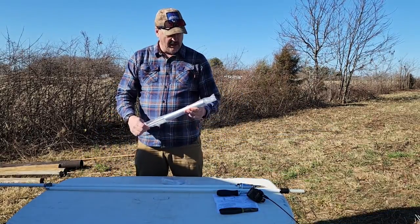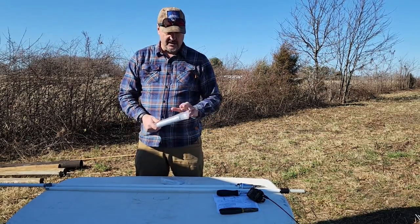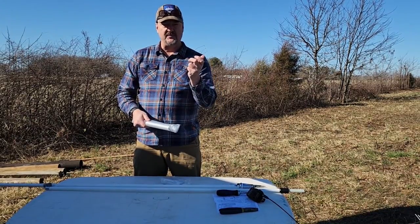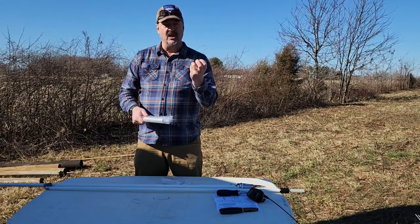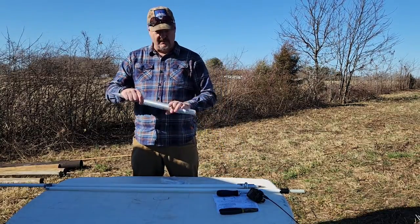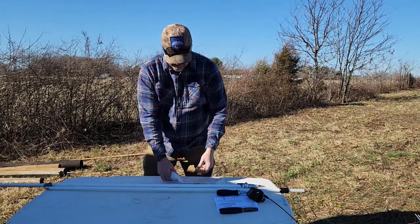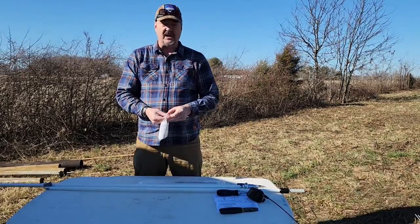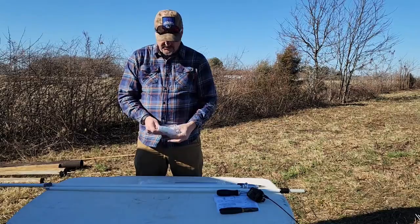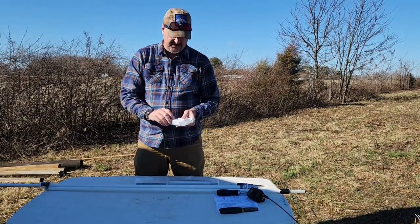We have a bag here. Looks like we've got our radials and the collar that fits down so that you can protect the UHF connector, PL259, that connects to the bottom of this guy from the elements. So we'll have this collar to put on. There's also a screw hole here, just like the other antennas, GP3, GP1. And then we've got our U-bolts, if you will, the mast attaching pieces here.